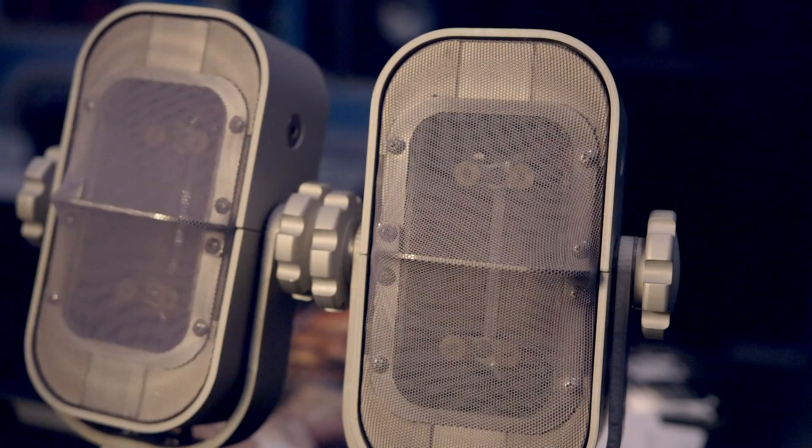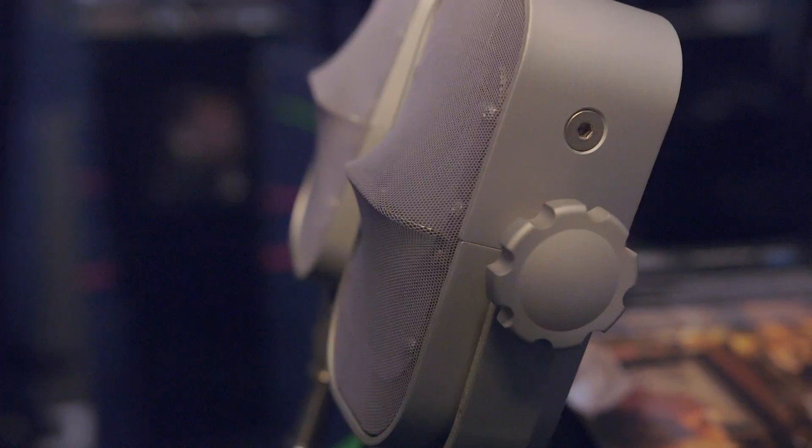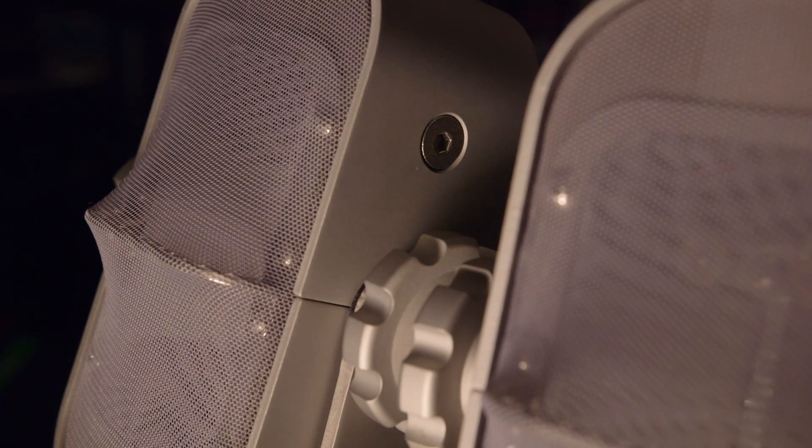It's also got a fabric grill. I really didn't want to put a metallic grill on this because they make that ting-ting noise. So this whole design evolved into a fabric grill on the outside and a fabric grill on the inside — you can see a rectangular frame — and it's a pop filter. You simply can't pop this mic, which is another unusual thing for a ribbon.